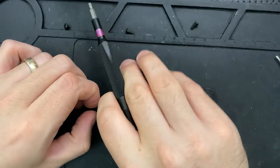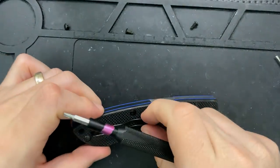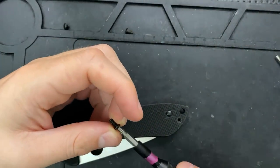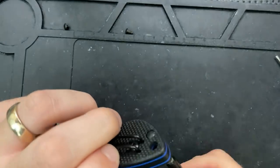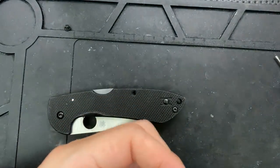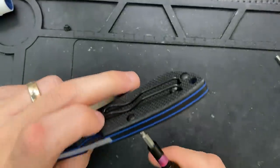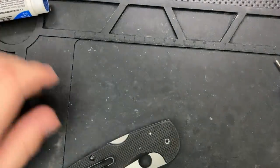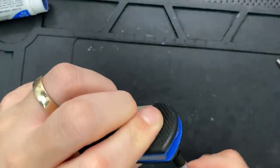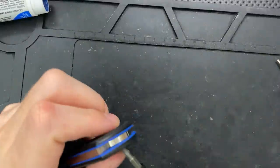Put the back spring in there. By the way, that was a neat little trick where when you get these wire clips, you hold the screw using the clip itself — that way it stays in the right orientation as you drop it in there, because trying to drop the screw through the top part but not through the bottom part is just awful. Put this in place — I'm not putting these too tight yet. Just very basic hand tight. You never want to put too much torque on anything. If it requires a lot of force, you've got to be careful, because unless that's the intended approach, you might break something.